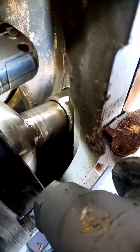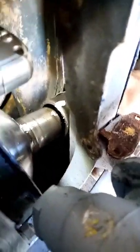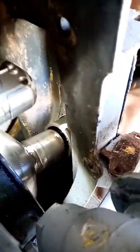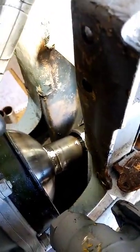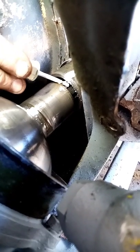When it gets to about there, Woolly will put a bit of Tip-Ex on. I can't Tip-Ex that. Can you not? No. I'll give you a bit more — hang on — a bit more out. Can you see it there, Woolly? Yeah, you'll get it there. So I'll hold it there and then we'll put a Tip-Ex mark on the spline, because it's on a master spline, and if you lose that then you're in a world of pain.